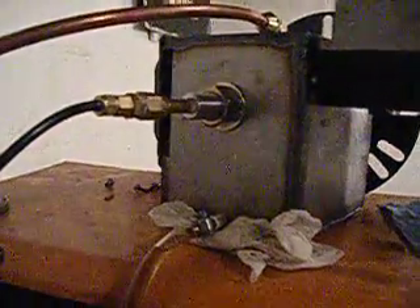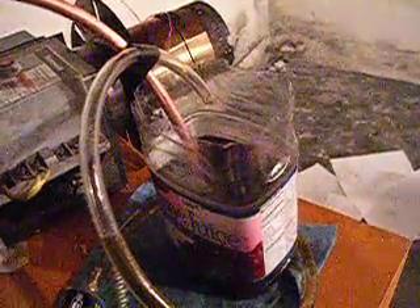This is an air pump from an airbrush kit. It supplies pressurized air into the back of the burner, which is necessary. The waste oil, because there is some excess, is picked up through this vinyl hose and goes to this 12 volt DC pump designed for car use, and then out of that into the top of this container again. That's the return.